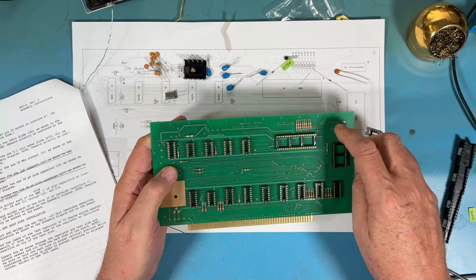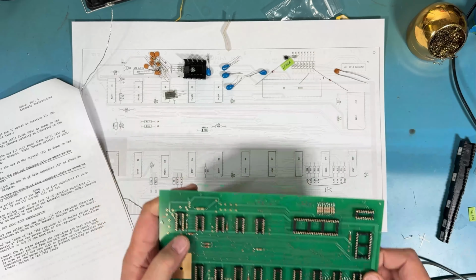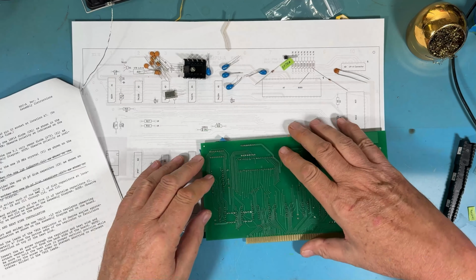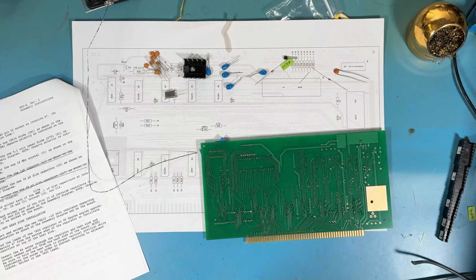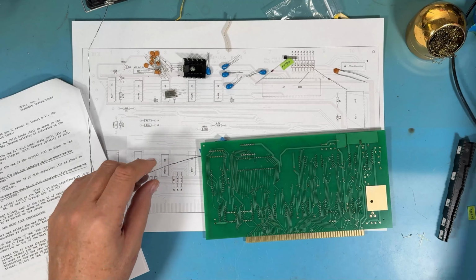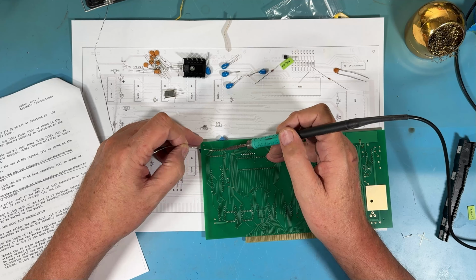This position up here, A10, is where the ribbon cable goes off to the CPA panel. And again, pin 1 is marked. I'm going to use a machine pin socket there myself. You may or may not have a colored socket in your kit. You probably won't. But if you do, the colored socket could go here just to differentiate it. Let me put on the good glasses. And we'll get in here and do our normal corner pins, flush, solder process.